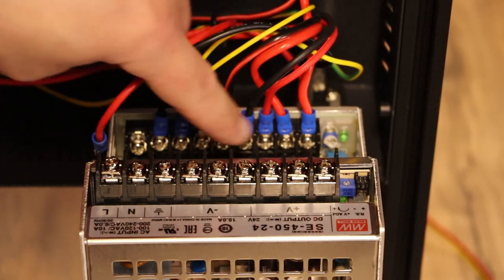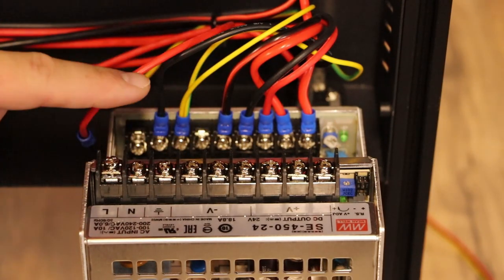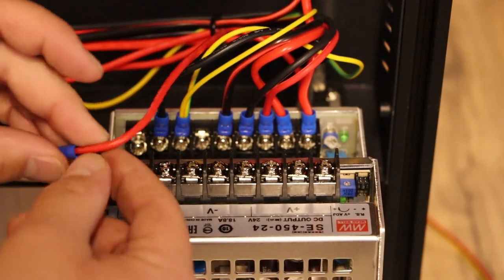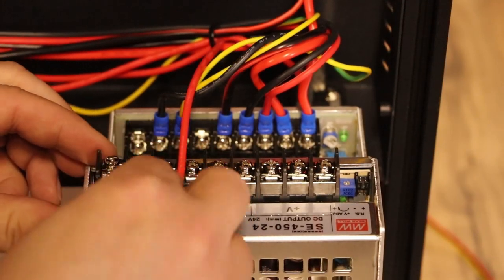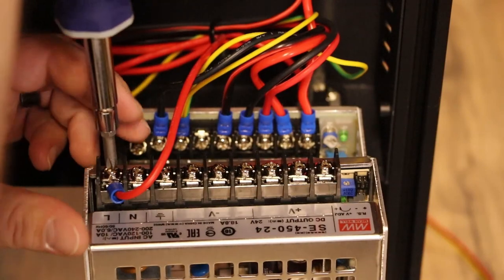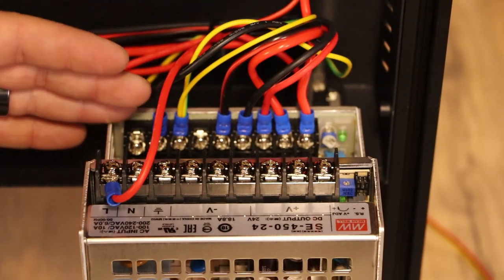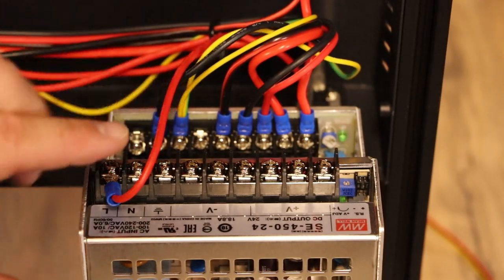The reason I do this is I want to point out that all of these connections are going to match up in the same spots on the new power supply. The best way I found to do this is to loosen one wire from the old one, take it out, then loosen the terminal on the Mean Well and push the fork connector in like this. Once it's in there, tighten it down and give it a little tug to make sure it's good. Then do that for all of them — just note the location in case you get one out of whack.